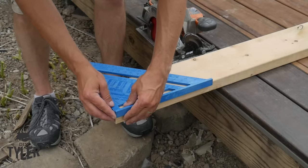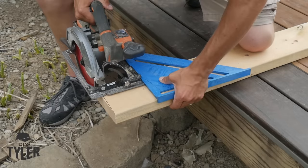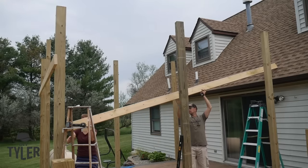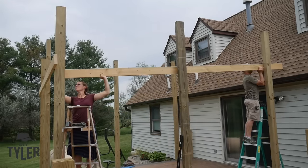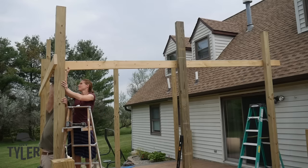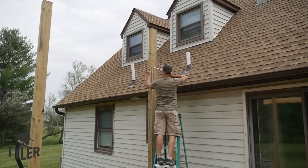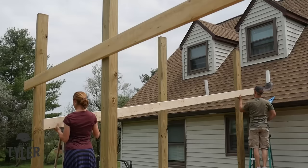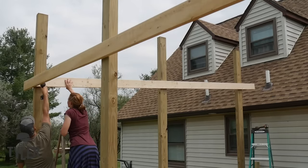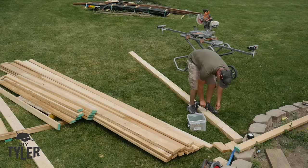There does need to be a slight angle on the outer edge — the edge away from the roof — to allow us to get that seven-degree or so angle to pitch the water off this roof. We slowly built this pergola frame from the inside out, assembled using two-and-a-half-inch Power Pro screws along with five-inch Power Pro structural screws, all driven with an impact gun and a Torx bit. They're really fantastic compared to the older style of using lags.